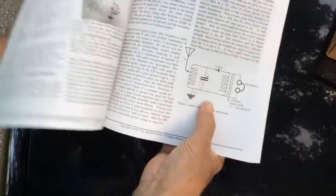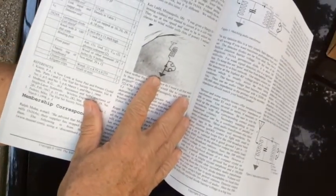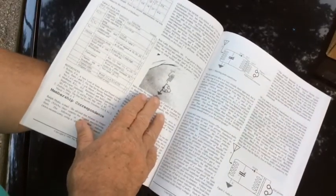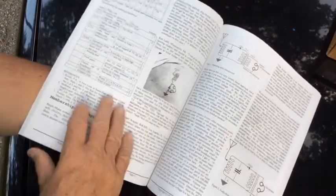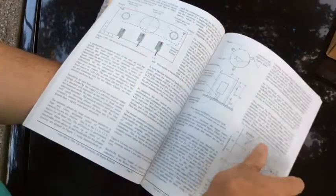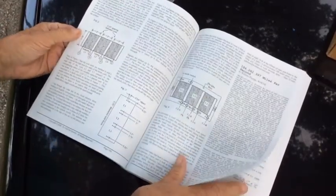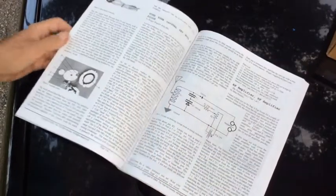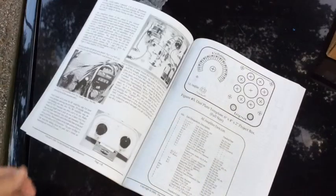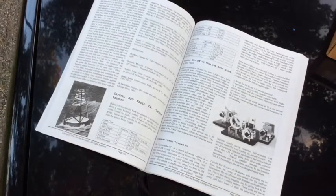Here's a very simple circuit — just a few parts. The reason for the simpler ones is that if you're close enough to a station, I've seen someone just put a diode on headphones and it works. It all depends on the strength of the signal you're dealing with. But in this book they go into more extreme measures to be able to tune and make the circuit much more sensitive, so we can start doing things like picking up shortwave radio and ham radio transmissions.